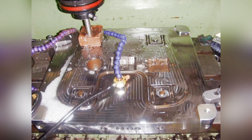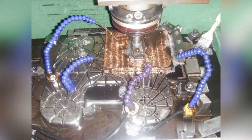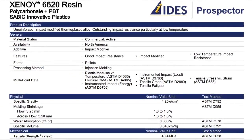There is another thing you need to pay attention to: shrinkage rate. Before you machine a mold, you have to check that the shrinkage rate you are using is correct. The right shrinkage rate for a plastic product is key for the right sizes. One of my customers had a terrible experience using the wrong shrinkage rate, which caused a huge problem with the plastic dimensions.